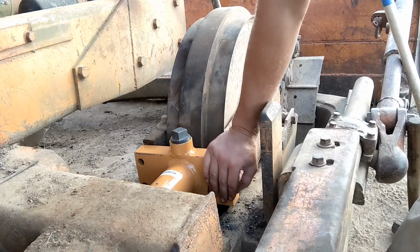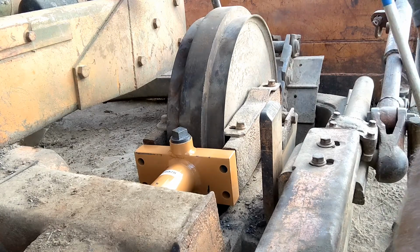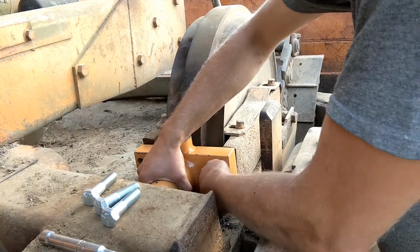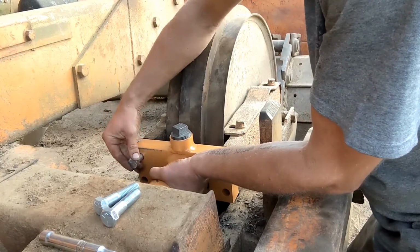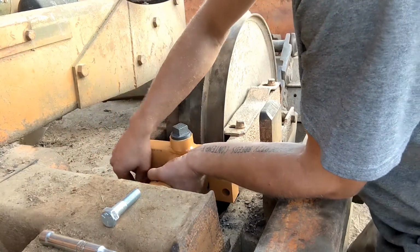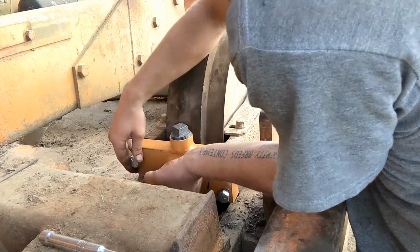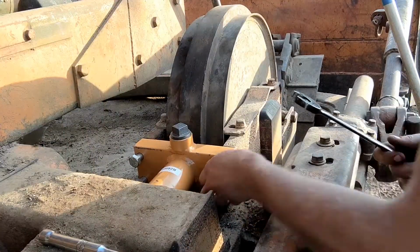I'll get these bolts in that I've got room out here to work, and then I'll use the backhoe. We'll shove this the rest of the way back in, and then we'll see if I can't start getting the tractor reattached. So give me just a minute here. Alrighty, so these are 5/8 bolts, which means I take a 15/16 socket. They also take a 15/16 wrench.